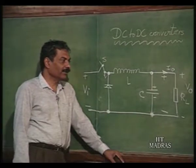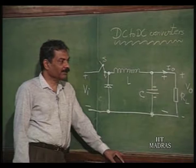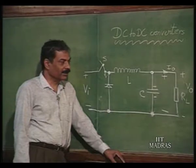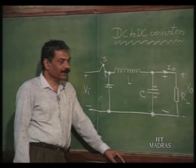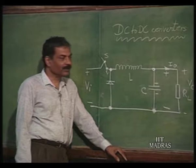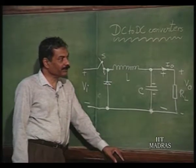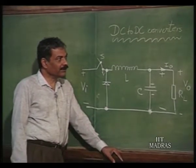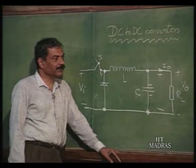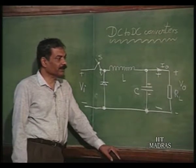But in high power, high current regulators, you would like to concentrate on efficiency. Also, the size of the voltage regulator depends upon the power dissipation, and therefore, small size good efficiency regulators are particularly required in space applications and also in places where size matters a lot. So, for that purpose we will discuss a regulator which is based on switched mode, like class D power amplifier that we had seen, where efficiency is very nearly 100%, theoretical efficiency is 100%.